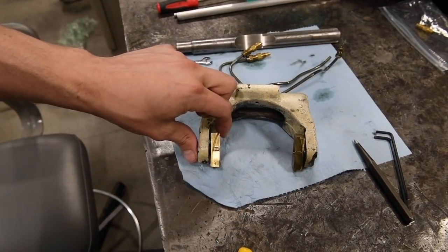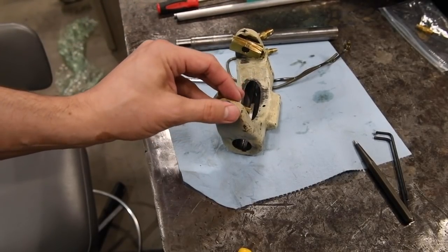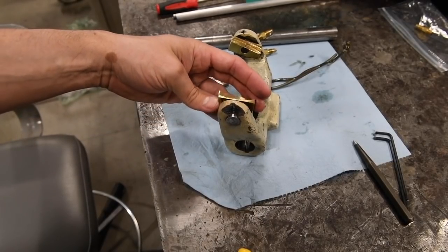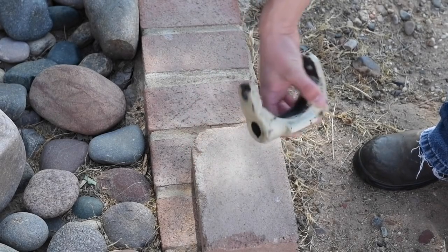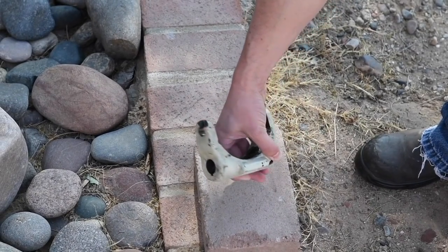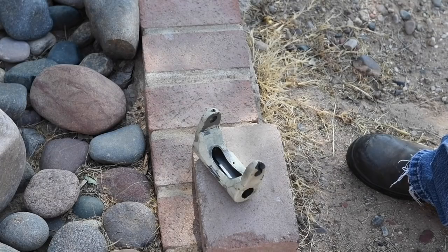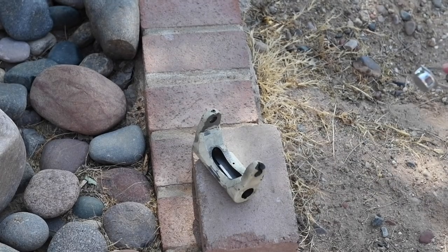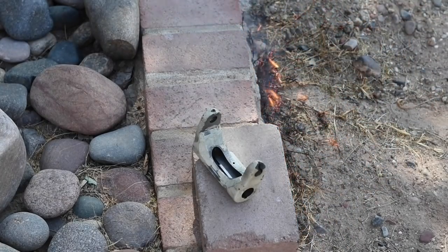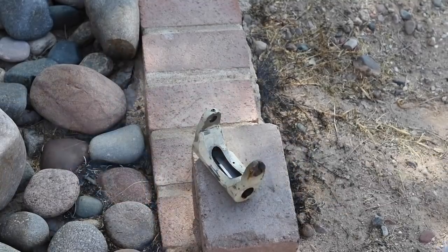Anyway, that's our part, so I've got to figure out how to make new ones and whether I'm going to take the time and effort to replace that missing corner of the casting. Knowing how I am, I probably will, but we'll have to see. In order to get this thing brazed up, the first thing we've got to do is cook all the oil out of it. I don't have an oxyfuel torch, so I've got a weed burner - just a large propane burner - so that's what we're going to use. If it doesn't work too well, then we'll move on to something else.